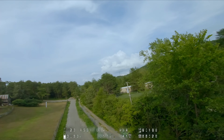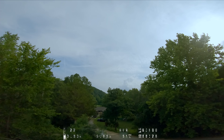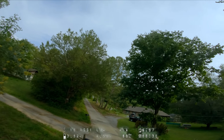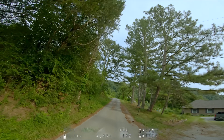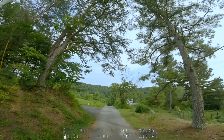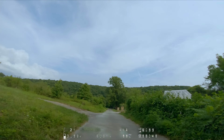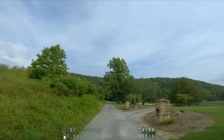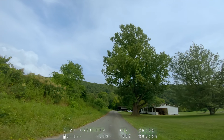LQ looks okay. Should I be concerned about RSSI low? The LQ is okay. Let's fly down near the ground so if I fail safe I won't fall too far and ruin this quad. Looking pretty good. 90 on the LQ. LQ is looking good. RSSI low, but usually if LQ is hanging in there, you can ignore RSSI.